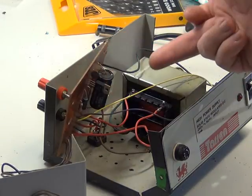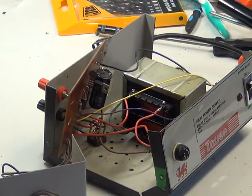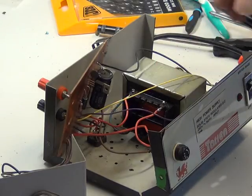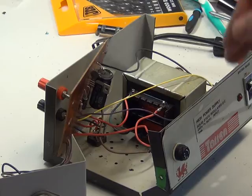The main smoothing capacitor on the power supply is 2,200 microfarads at 35 volts. And there's a small one there which I can't read at present. So you've got a nice transformer — maybe it's a 70-watt one, this. That's the 5-amp version.